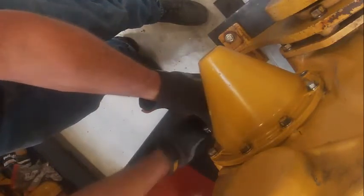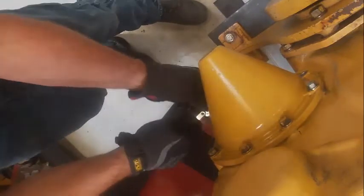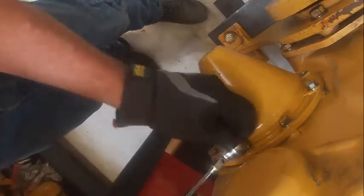There's a cover that goes here we'll put on in a second. I've got a bunch of holes here that need fixed on this cover — I'm not going to do it today, I'll leave that for later, just for time's sake. Basically what I'd have to do is drill it out and put a key insert in it to put it back to its original size.